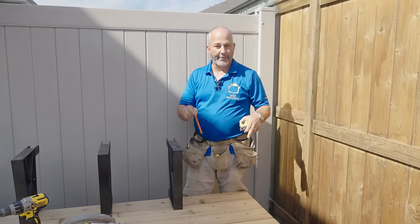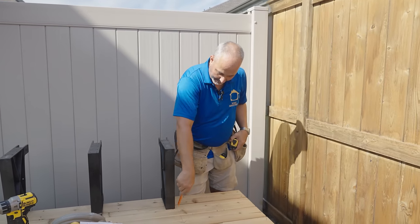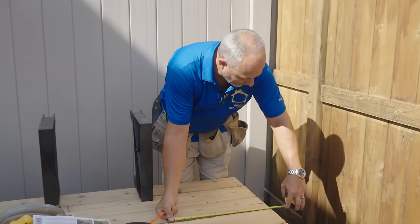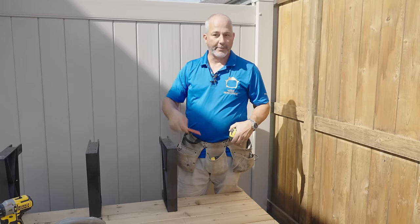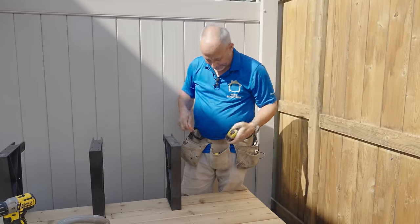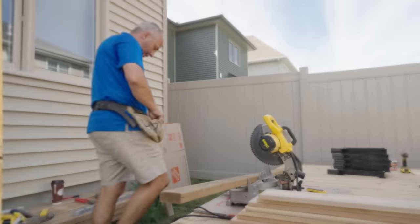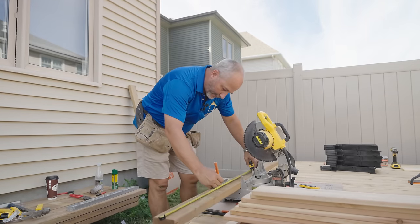I'm just gonna cut 4 2x4s at 22 inches. I'm gonna cut a bunch of boards that are the full 1x6, that's my outside dimension. We're gonna go 18. And because I like it to be super sexy, I'll just use the miter saw. We're gonna cut everything with a miter joint in the end to meet nice and clean. Anyway, enough talking, let's do it. All right. Cut 22.